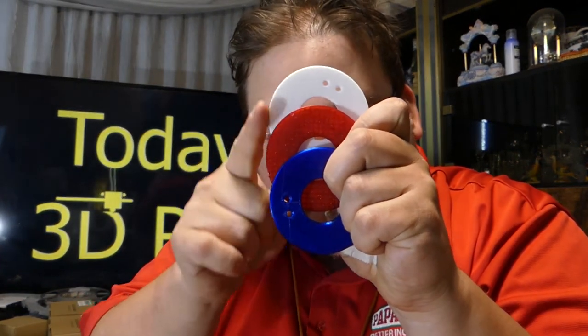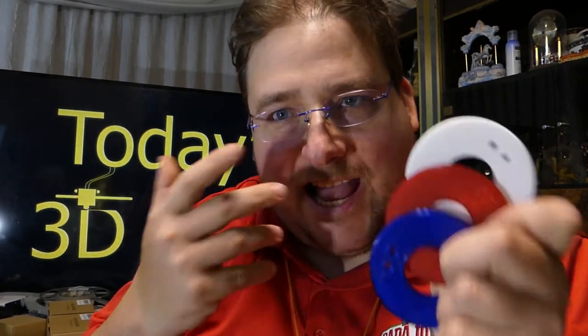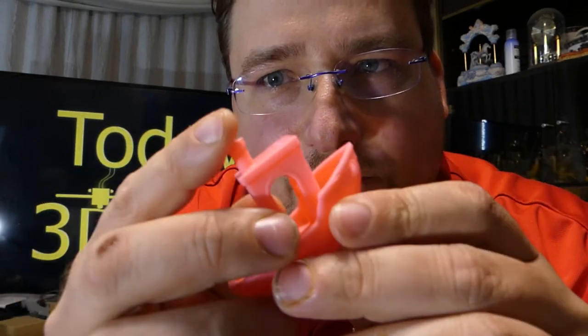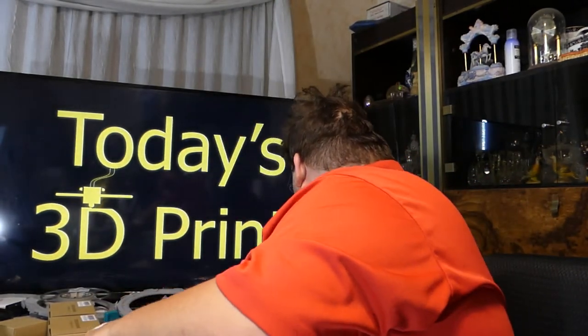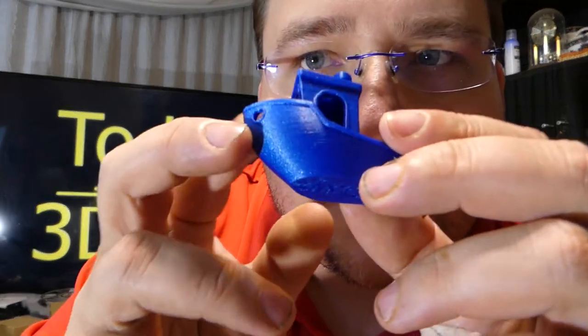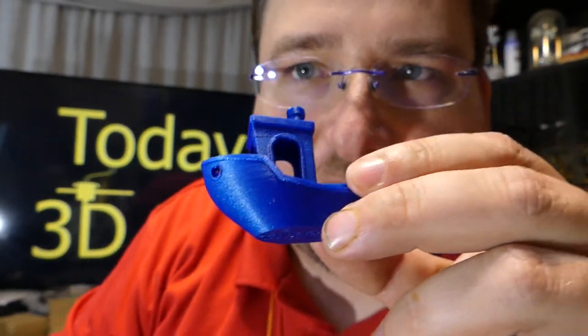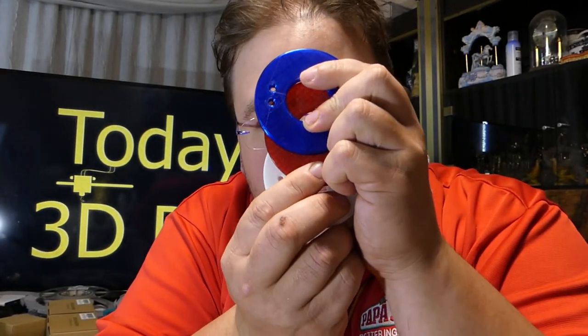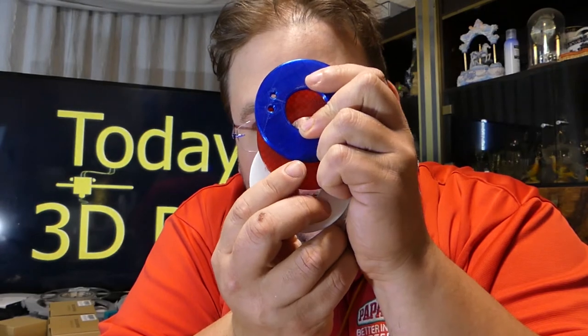So you have two things that cause you to see those layers: the actual size of the layers, and then the precision of your printer to accurately place each layer on top of the previous layer. That's why prints such as from the Z5F, you know, they're okay, they look good, but you can clearly see them. But then you look at a print from the Ender 2, and you can't even see them. They just disappear, okay? Because that printer is extremely good at laying layers on top of each other in exactly the same position as the previous layer. Any slight discrepancies in laying one layer on top of another result in little changes in the surface of the model as those layers shift around, okay?